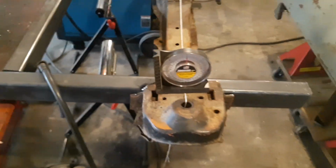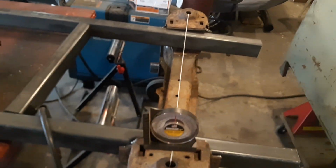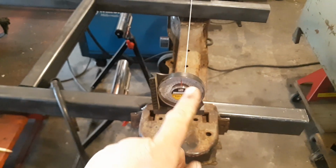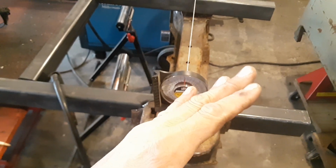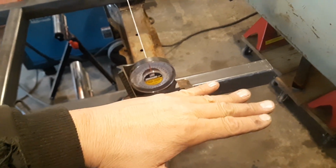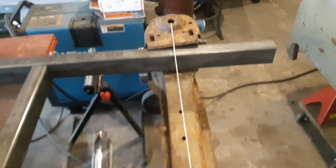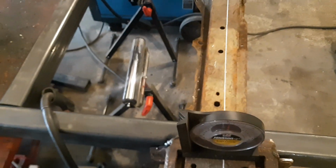All right. We're back again. First of all, I got the Mustang 2 front crossmember tacked into place. I got the 5-degree anti-dive. You got to tip this back 5 degrees, so when you pull up to the stop sign, it doesn't dive. You know? So you tip it back 5 degrees to reverse the front suspension. So I got that just tacked into place right now.